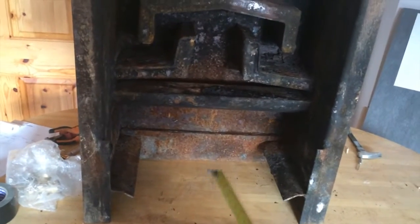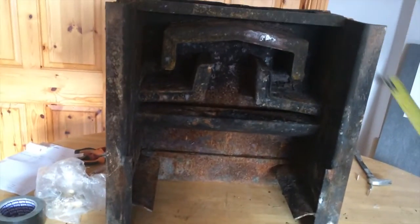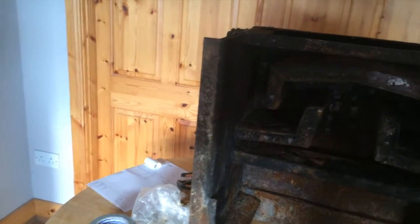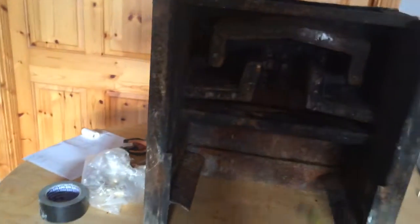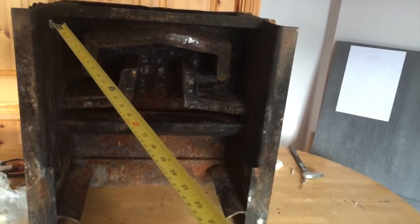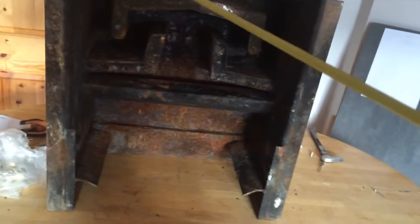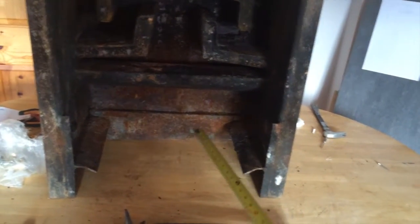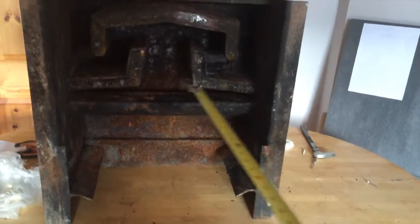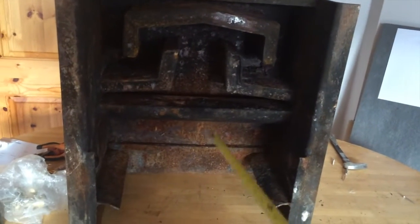Now I'm going to obviously modify this design a bit. I have little steel hinges, and I'm going to put 2 little doors on this and a damper plate down here. There's going to be another mechanism up here, like a sliding plate. When the plate is pushed back and closed up here, the fire just wants to come out and head up in front of this main boiler unit. That's good for pumping out some heat directly into the room that the fire is in.